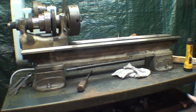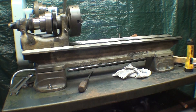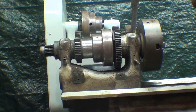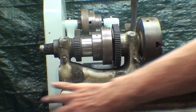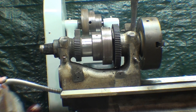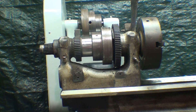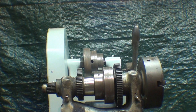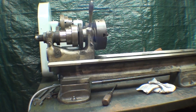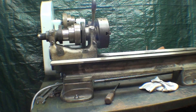The further I get into this job, the more things I'm doing that I was not planning on doing. The next thing I was going to do was clean up the bed real well, but now I've decided I'm going to take the headstock off and clean that up. Remember, there's a bad gear in there — I don't think I intend to do anything about that, but I'm going to take the headstock off. I've already removed the guard and the gear guard which held the switch. There's just one or two bolts and that will come right off, and I also have to unlink the belt tensioner. So that concludes this video, and I hope you're enjoying this little cleanup and inspection of the South Bend 9-inch lathe. This is Tubal Cain saying so long for now, and I'll see you in my next video — thanks for watching.